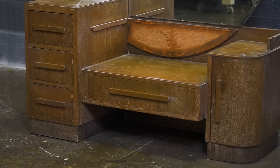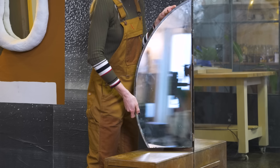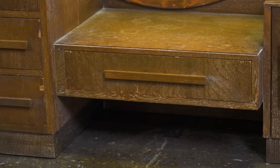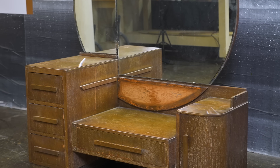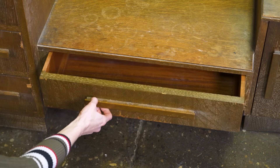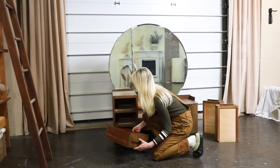Upon first impressions, I believe this vanity is of the Art Deco era, as furniture from this time often features these clean, sleek lines and organic curves. Right now it's obvious this piece has seen a few eras — it's definitely been stained multiple times, and it looks like it was even painted at one point. You can kind of see the way the old paint is trapped in some of the grain. There are surface stains, the mirror is missing at the bottom, and it looks like there used to be a shelf at one point. Overall it has a beautiful walnut veneer that unfortunately has some damage and wear in a lot of areas, but I think it would be so cool to try and bring this thing back to its original state. Right now I just want to get this whole thing disassembled and then start working towards salvaging this old veneer.